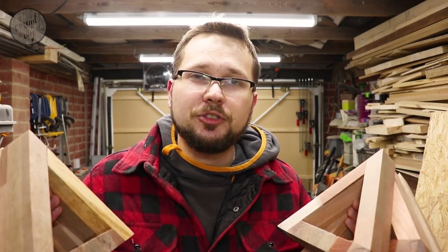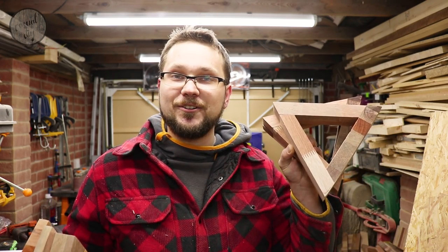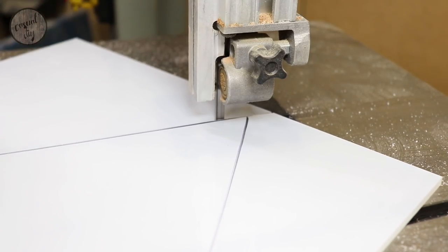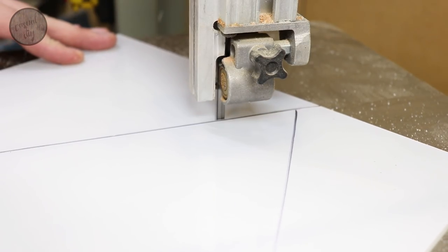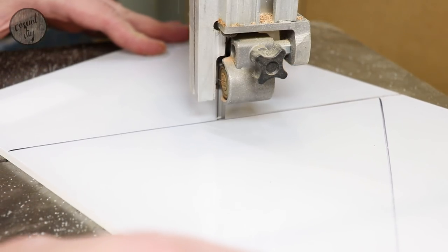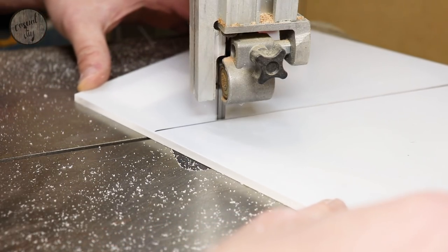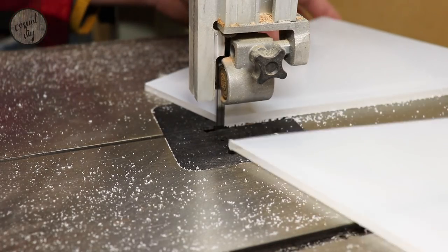It's all chopped up into six pieces. Now it's time to make the acrylic shapes to match the triangles. To cut the acrylic I'm using my bandsaw — make sure not to cut on the lines, go a bit outside so you don't end up with less material than you need. We'll sort it out when sanding and get everything flush with the wood.